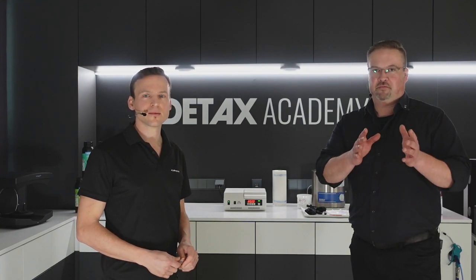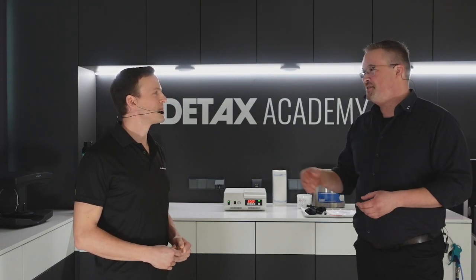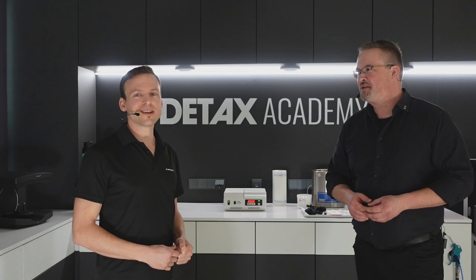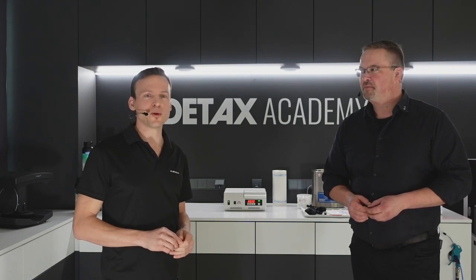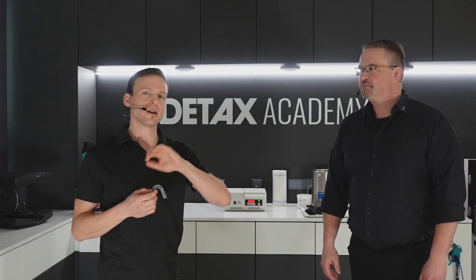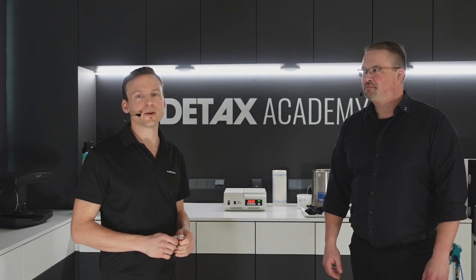Thank you for your time and for watching. Stefan, thank you very much — it was a pleasure. We talked about the next webinar topic: you can start with 100 micron and go to 50. We have so many cool features that many people don't know about. It's called multi-range, which means you can use several different layer thicknesses in one print — speeding up part of the print with 100 micron and then going to 50 micron at the point where surface quality matters most. This speeds up your print tremendously while making a really nice surface where it's necessary. No compromises — you can tailor it to your print as needed.